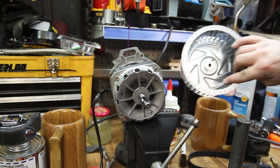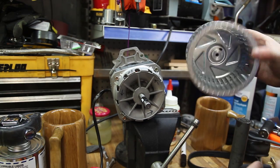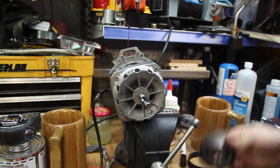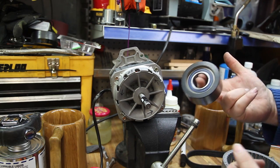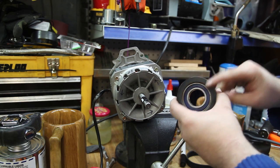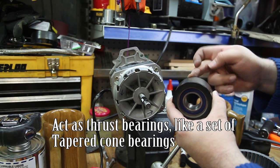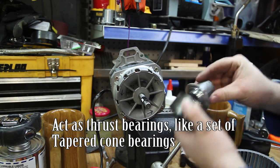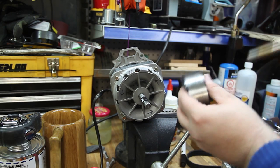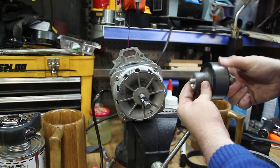Of course if you do it on just the shaft it gives you odd results because it's picking up the facets for the pulley. We have one of these squirrel cages from whatever application it may have been — we're going to use that as the extraction fan. But we don't have the pulleys to make all this work. We do have a bunch of these idler pulleys — quite nice, quite robust. This is a dual ball bearing idler pulley with thrust; the two ball bearings allow you to have a bit of thrust or push so it could be off-centered. A big bolt goes through here to mount it, which offsets it and then allows your 8-groove belt to spin on it.